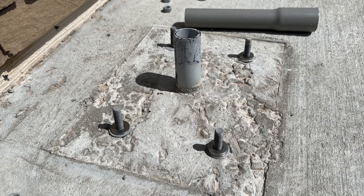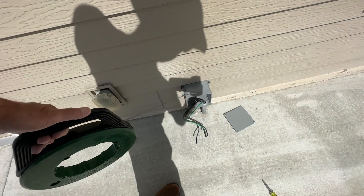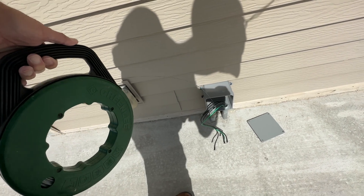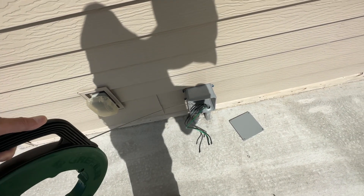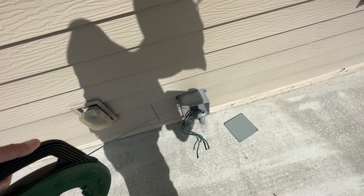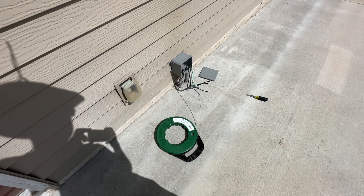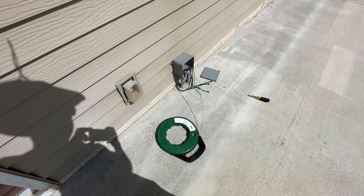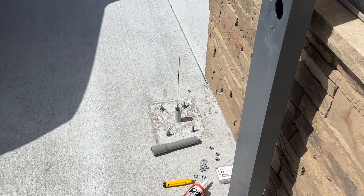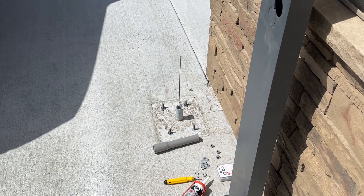Next, I've got to take this fish tape — it's a spring steel band. You jam it in the conduit and it comes out the other end; it's used for pulling wire. That's what we're going to do. Just like that, it comes out the other side. Look, there's a snake coming out of the hole — that's where we hook the wire and we'll pull it right through.